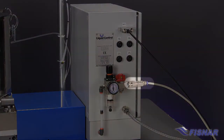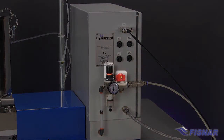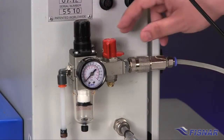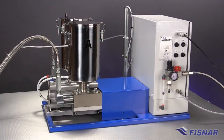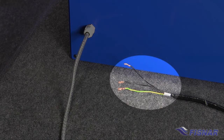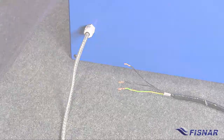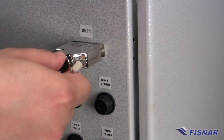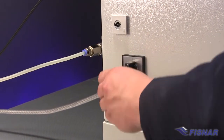There is a female ¼-inch BSP connection at the rear of the machine for hookup to your clean-dry air regulator. Once air is connected, locate the main air isolator switch and air pressure regulator at the rear of the machine. Turn on the main air isolator switch and set the pressure gauge to 80 PSI. Depending on the machine voltage, a 110 or 220 volt power cable will be provided for connection to the LC120FR. The cable will be bare at the power end to receive a suitable customer-provided power connector. Hook up the power cable to a power outlet. Connect the I/O cable from the robot to the DIO connector labeled at the rear of the LC120FR. Turn on the electric isolator switch at the side of the machine.